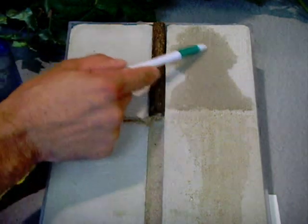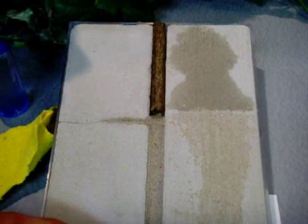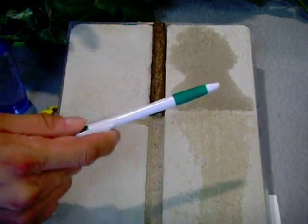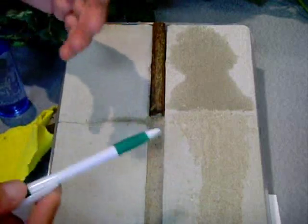In other areas, like the Midwest and northern states, this is what really damages concrete. The water goes into the concrete, freezes inside, expands, and breaks the surface, creating all kinds of problems. On the sealed side, the water stays on the surface, it's easy to dry, and the water is not going to penetrate — so there's less likelihood of the concrete getting damaged.